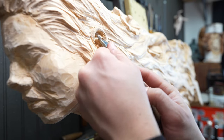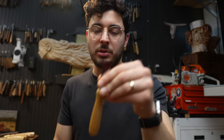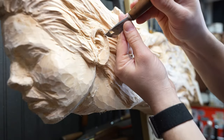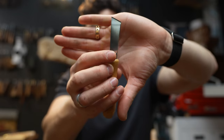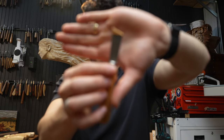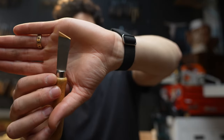First, let's talk about leverage. You can use the skew to push into the fibers of the wood, putting your body weight into the tool in the same way that you would a chisel. It also has dull sides that don't tend to get in the way of the carving as you're moving along. The knife has a much wider sharp edge and it can get in the way — if you've carved for long, you can imagine what I'm saying.